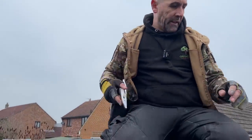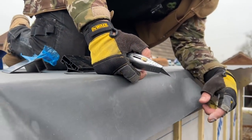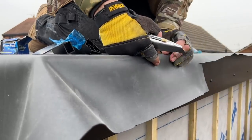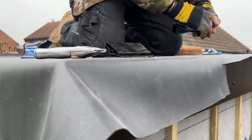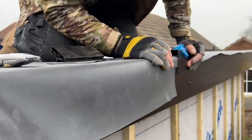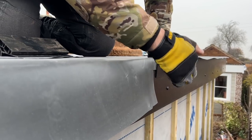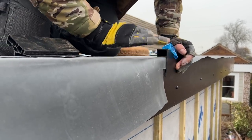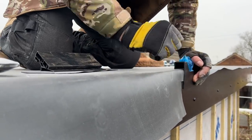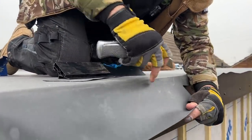Right, so we've got this rubber on, bonded down, we've got all creases and bubbles out to the best of our ability. If you've got a few creases this time of year you're not going to get them out, so I wouldn't worry too much about it — aesthetically is the only issue. So what I want to do now is cut this rubber off. That's how the curb trim or P trim sits on the roof — you can see it's mechanically fixed down, no wind lift is going to get up there, and that's fixed to the side of the fascia. In my opinion there is no need for that contact adhesive around there — it serves no purpose because that little baby's holding that down.